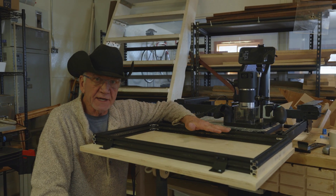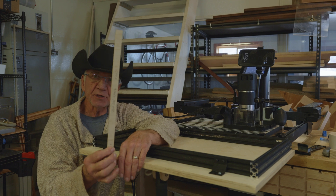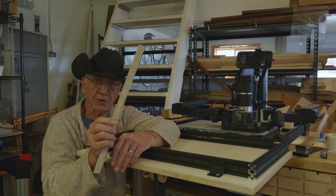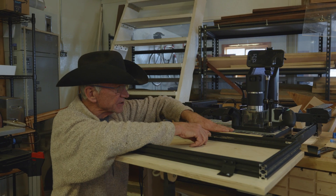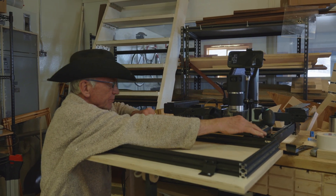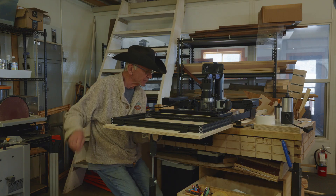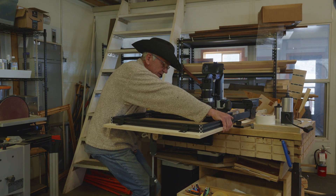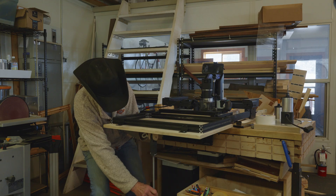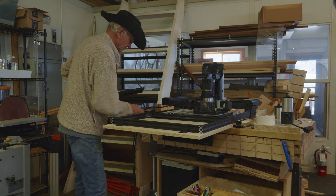To use the Z sled, you have to have the front rail about three millimeters below the level of the work surface, because the sled is about three millimeters thick. I made a little strip — a 10-20 millimeter wide strip cut from one-eighth inch ply — with a quarter-inch by quarter-inch strip of wood underneath just to hold it in place. Then you use the normal alignment bar for the Shaper Origin, pull everything up tight to square it, clip it in, and get your leg support going.